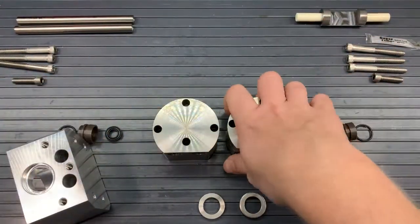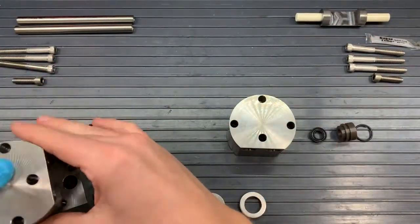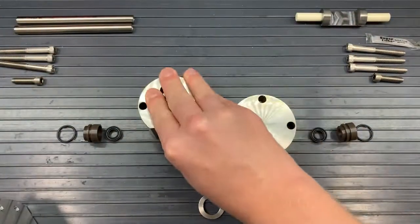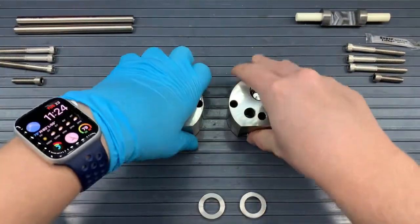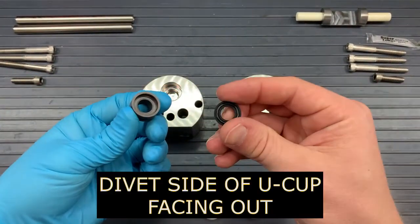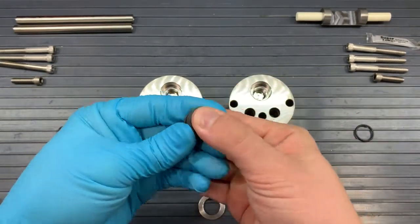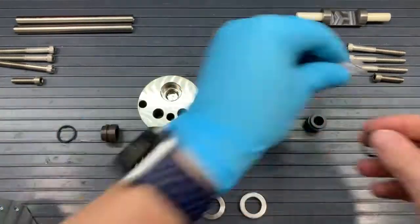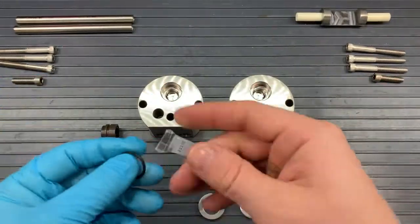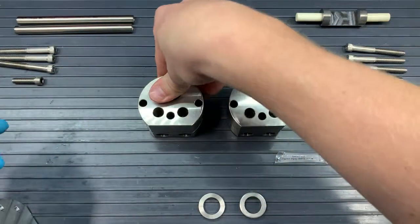Double check that the X's and O's are in the right spot. When we put those heads and stuffing boxes onto the crankcase, the outlet is on top and the inlet is nearest that notch on the bottom. Once that is checked, we can now put our plunger guides into the stuffing boxes. But before we do that, we want to put our U-cups into the plunger guides as well as the O-ring on the outside of the plunger guide. We will grease that O-ring with the grease from kit A and kit B, and slide that around the plunger guide. With the smaller end facing out, push the plunger guide into the stuffing box.